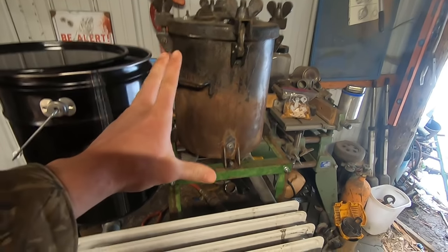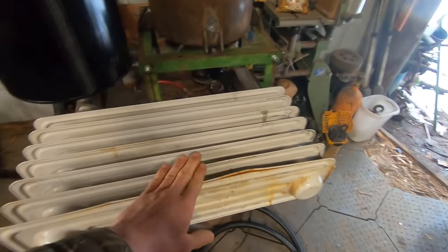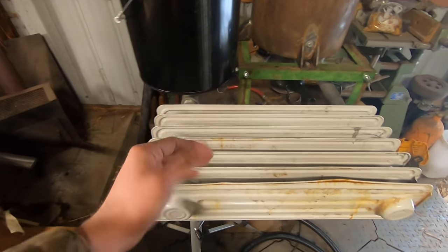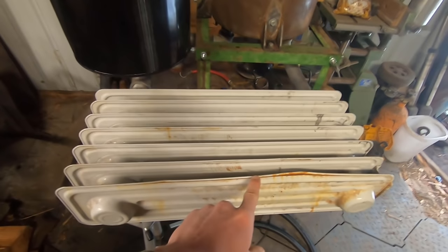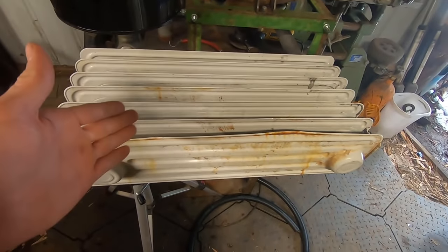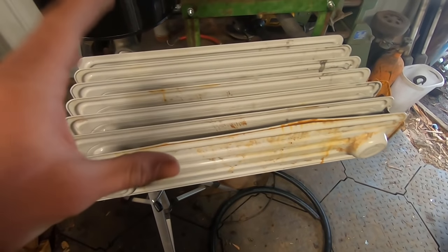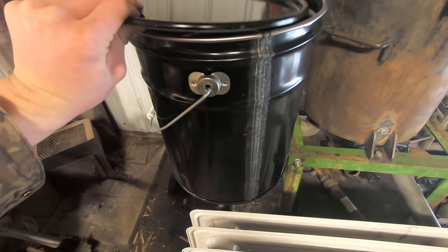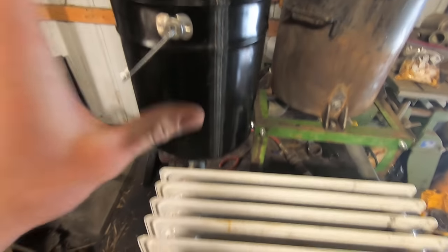We have a reactor, which you saw how to build, which is piped into our cooler, which is going to get as much heat out as possible, which is why it's in this orientation here, to hopefully allow heat to go up and out and not up through the top of here like it would be in a standard oil heater orientation. I'm trying to get rid of it as readily as possible. And then out of that, we have just a simple pipe going into a bucket. In that bucket will be filled some medium that filters out any contaminants, or at least as many contaminants as we can.